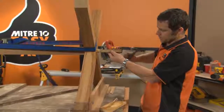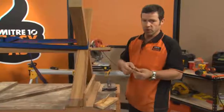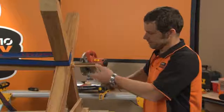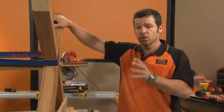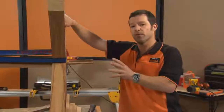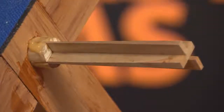Going to take a nice long wedge that we've made out of Remu, and we've got two little wedges to go on either side of that one. This is going to form a beautiful little cross on the end and also set that dowel in there nice and tight. Sweet. She's all glued up, everything's set. Now we're going to just let this glue dry for about 24 hours and then we'll end up chopping that off. Before the glue dries, wipe off any excess.